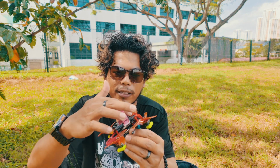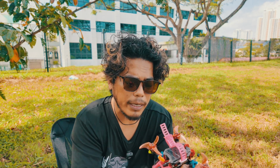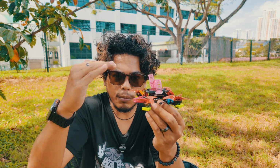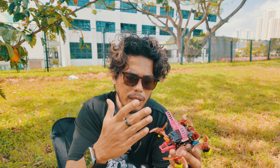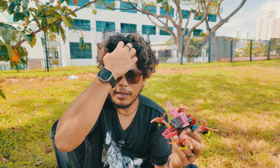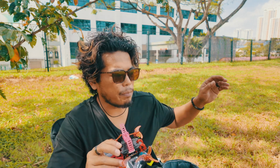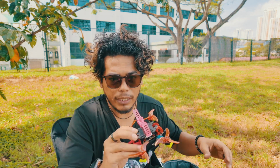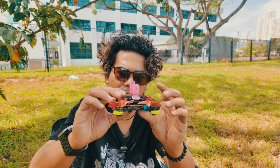So because of that, I had to change my standoffs. Of course, you can run the old standoff, but I want everything to be lower, to be squeezed, so the CG will be lower, and eventually, I assume the handling and the performance will be better. The default standoffs that came with the P25 with the O3 was 28mm. I managed to go down to 20mm.